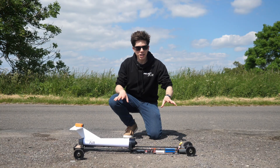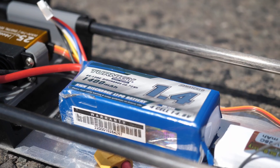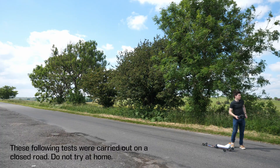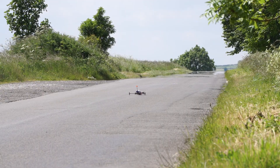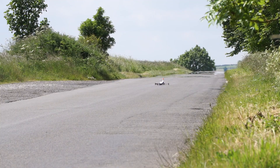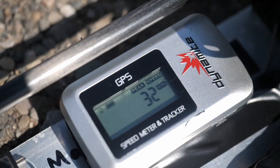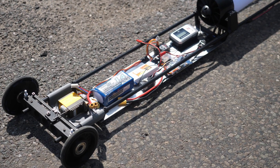I've got the rocket system all set up. I've done a few changes to the car and added a GPS so we can measure what speed we reach. First, we're going to see how fast the car goes on just the EDF on this nice flat surface. After that, I'll drive it with the fan and then ignite one of the rocket engines as a boost. The EDF-only run reached 32 kilometres an hour — that wasn't very fast. There also aren't any brakes on this car, which is something I perhaps should have mentioned. Maybe a higher voltage battery and an intake lip on the fan would help in the future.